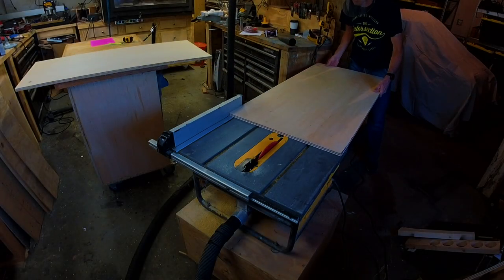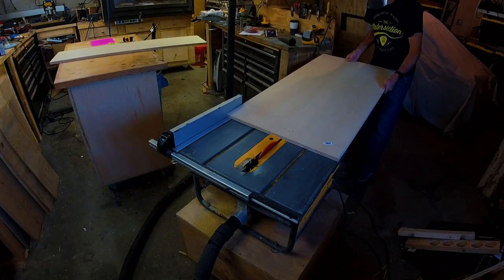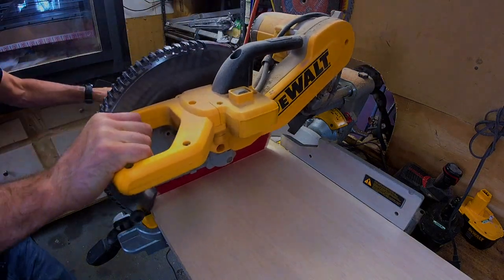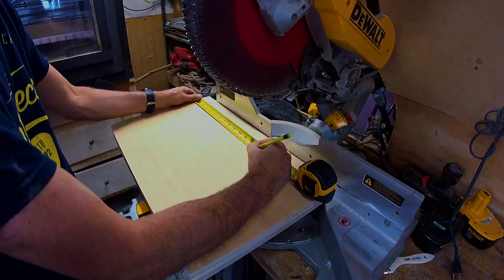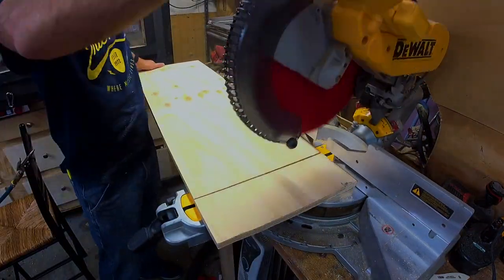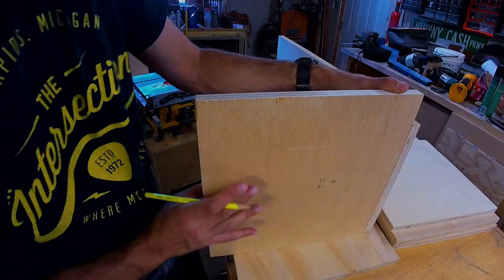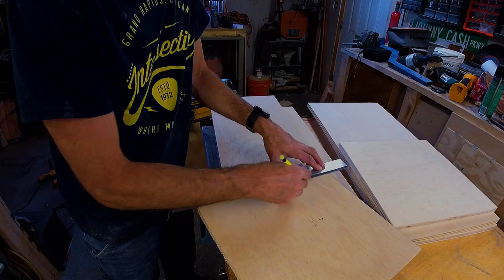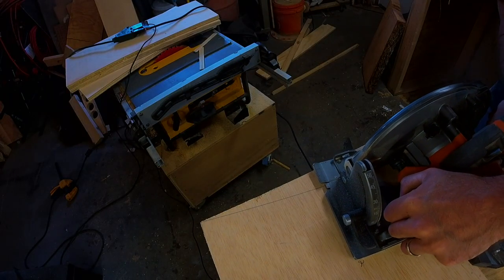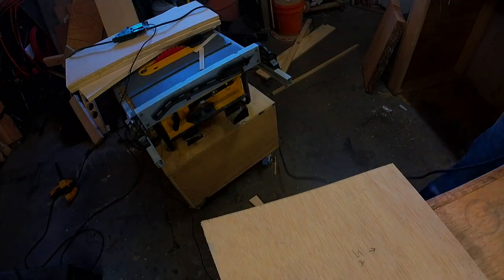Hey everybody, today we are making a 2x10-inch speaker cabinet for guitar. We're starting out with 3/4-inch hardwood plywood and cutting everything to size. And we're starting to assemble the cabinet itself, but before we do that, we're going to put a 10-degree bevel on the front, so the front of the speakers tilt back just a tad.